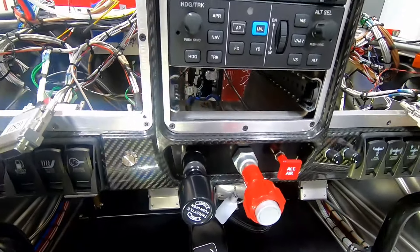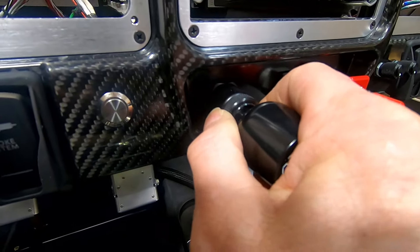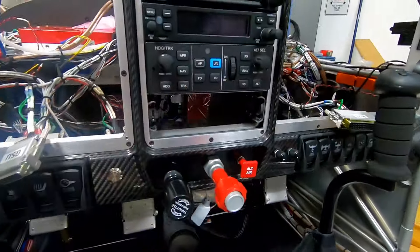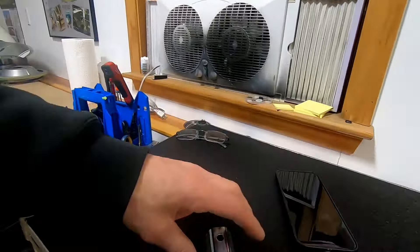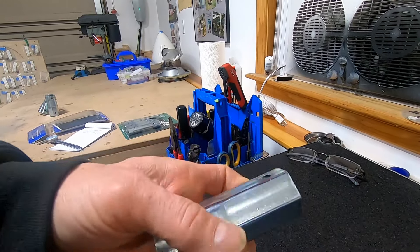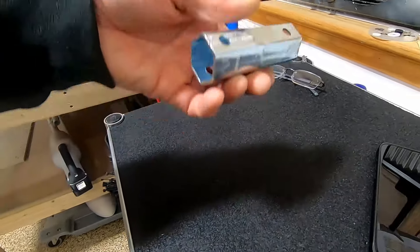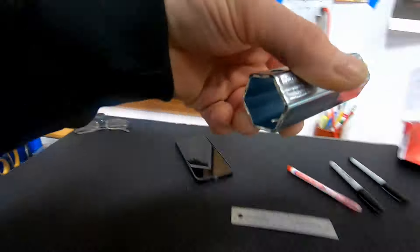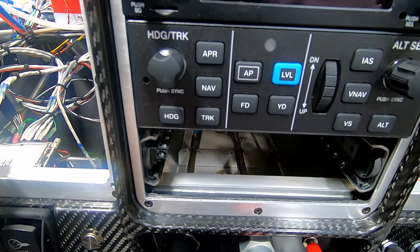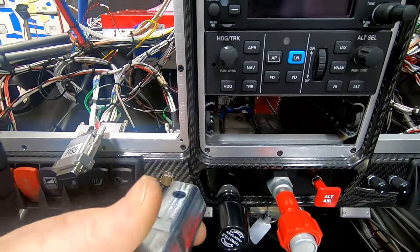I was futzing with these and put them to the test, and as I'm tightening this I realized I must have had super strong hands and need to tighten those nuts some more in the back. So back to plan B version 2 - I bought these things and the nuts are one inch, this is like one and one-thirty-seconds, so I'm going to cut this open and hopefully reach inside that little hole and fit it around the throttle and mixture cable.